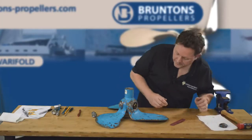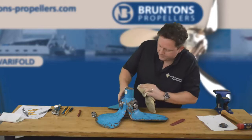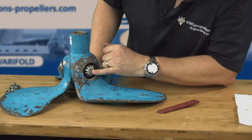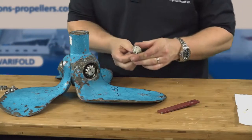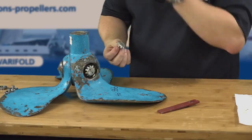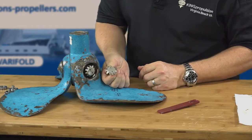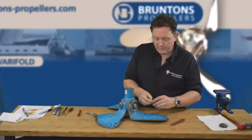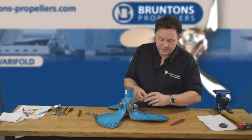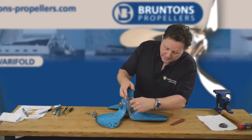The next thing we need to look at is just to reveal what's called a tab screw — little tabs just like that. Now on this one you may think it says H7, but it doesn't. It actually says LH — left hand — so it's a left-handed thread. To get it off you go the opposite way, as though you're tightening it rather than loosening it. This just helps to keep everything on.